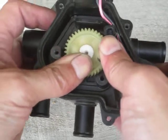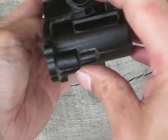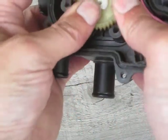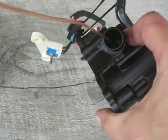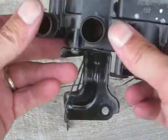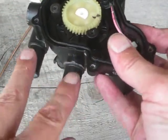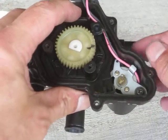As I rotate this to about the 3 o'clock position, this port becomes just barely open. You can drop a wire in there and it becomes barely open, and I still have unrestricted coolant flow between these two ports. So I have unrestricted flow here and just a trickle of flow coming in or out of this port right here.